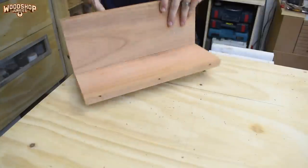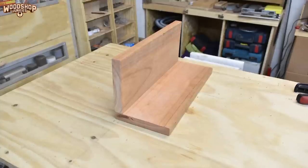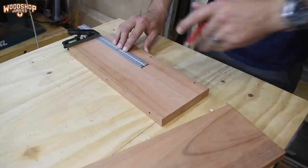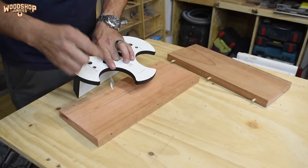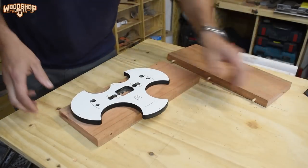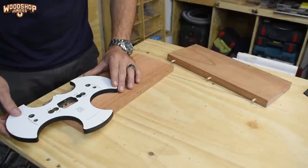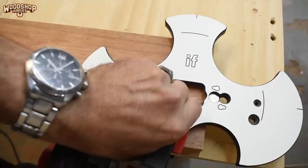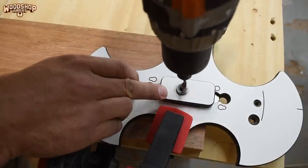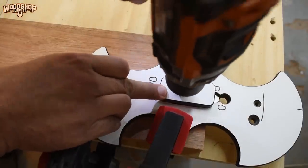So the corner joint went together just as nicely as the edge joint, and once again, jig setup was key. Now when creating joints towards the center of a plank or a panel, where you do not have the luxury of using an edge to reference using the fence, you would need to draw a guideline and align the jig using the guide indicators on the jig face.